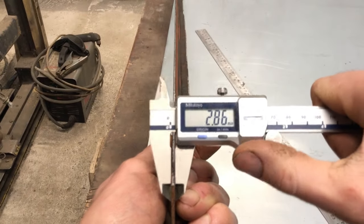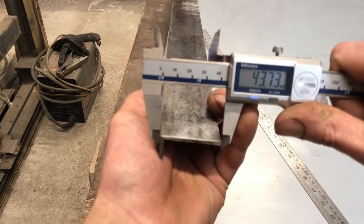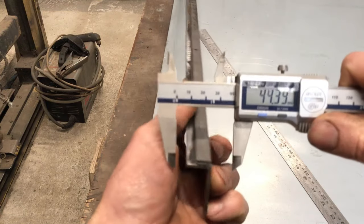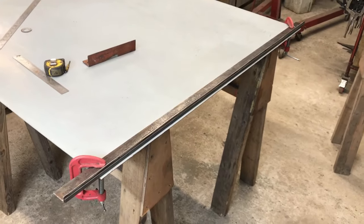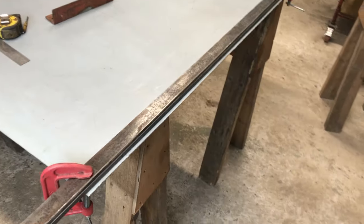The angle I have chosen is 3mm thick with a long edge of 40mm, and I cut the short edge to around 17mm. Now I am going to use it to cut this edge and then measure how well it did.